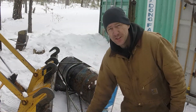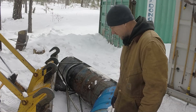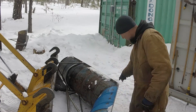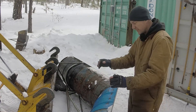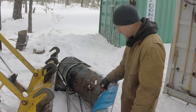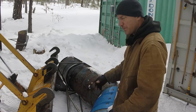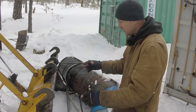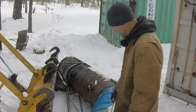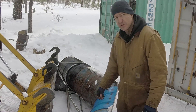It's all welded up now, nice and solid. I'm pretty confident with it. At one point I had the bucket tilted up so the nose was straight into the ground, and I just put a little bit of pressure on it to see if it would lift the front of the tractor off the ground. The front tires got light — I didn't pick them all the way up off the ground but they got a little light. You can see them kind of adjust as some of the pressure was taken off. I think it's pretty strong. I'll give you a closer look at what I did to reinforce it.